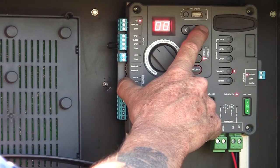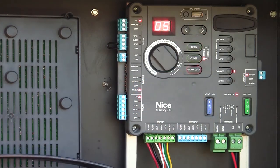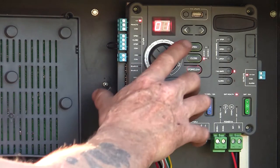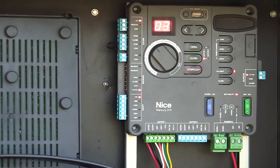Using the left and right buttons, we can adjust the force level all the way from zero up to five. The higher the number, the more force it will exert before it senses an obstruction. The lower the number, the less force, or the more sensitive it will be when it encounters an obstruction. We can adjust this to whatever level we feel is right. I'm going to set mine to level three — it's going to flash a few times and it's set. No need to press OK to confirm; it self-sets.